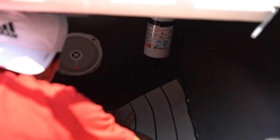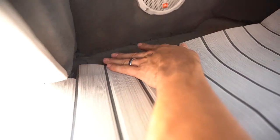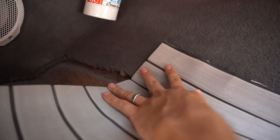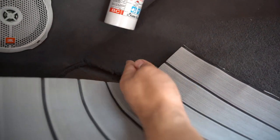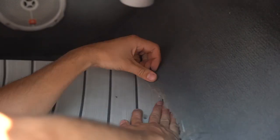I'm going to look at how this side is — so this is good, but I'm going to have to cut this at an angle. I'm laying the rest of this material down here and as you can see this carpet kind of starts to turn in this way. I was contemplating whether to press this up against the carpet, but what I'm actually going to do is put it underneath the carpet and cut it along this edge so it fits neatly underneath.